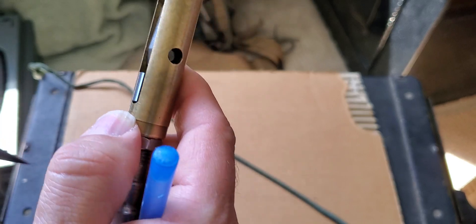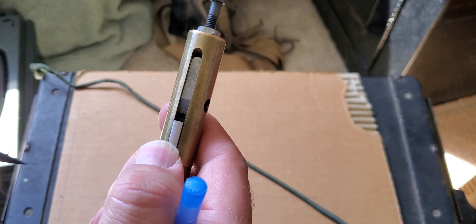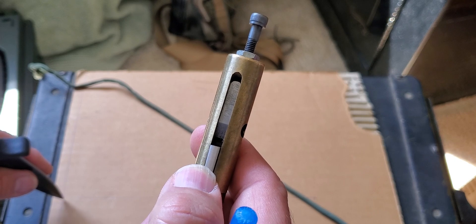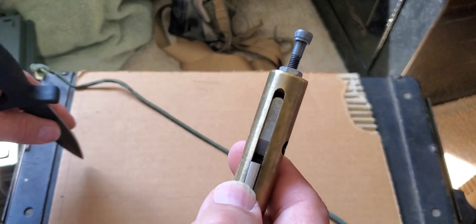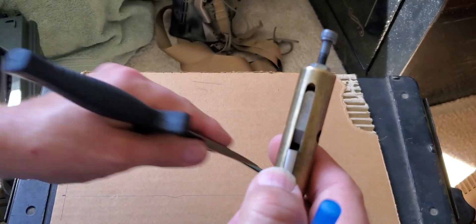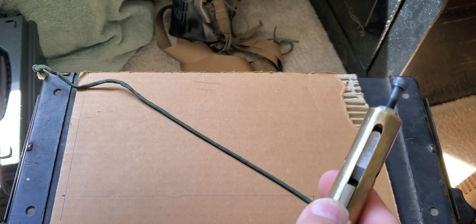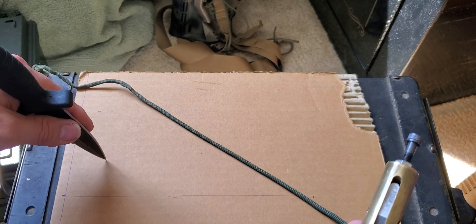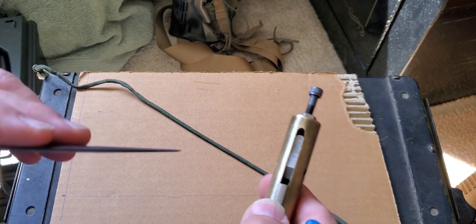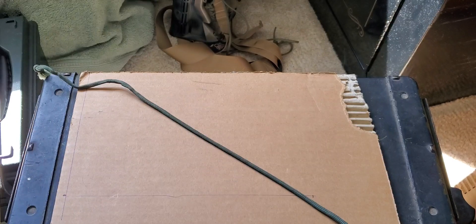Now, if this is a really slow twist cutter - one turn in 52 inches - that would be one fifth of this, be much shallower. This mark would be down here. But this angle here represents the angle that we're going to put on this cutter. So we don't need any other tools other than the surface to lay this out and compare this cutter angle to the angle we end up with here.